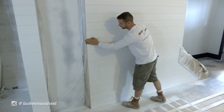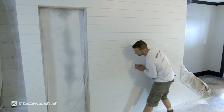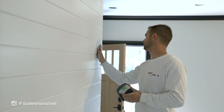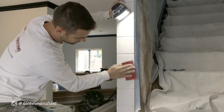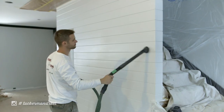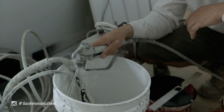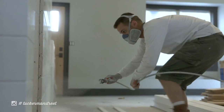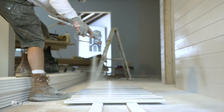The finish process after primer is basically a ton of sanding. We start with 180-grit sandpaper and work all the way up to 320-grit. Before and in between every single coat, every substrate we're touching gets sanded — we're trying to create that tooth for all the finish coats to bond to. Then we use the primer as our chemical bond so when we leave, everything is strong and works well.